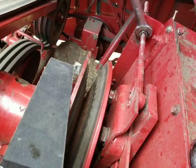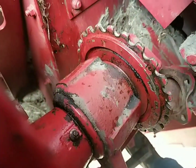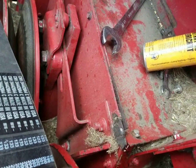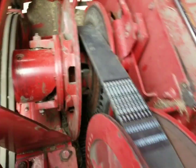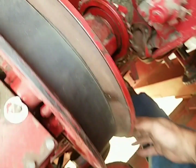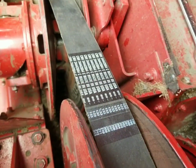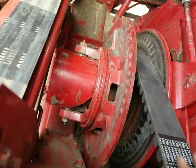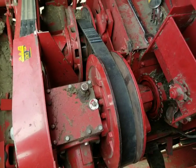But you've got to loosen these two bolts first. It moves slow, not very fast. While you have this apart, this is a good time to thread all this out and really lube it up good so that this little electric motor can turn it easily. What you'll actually have to do is get the belt back out of this pulley, lay it to the front here, spread this one out, then get this belt inside of here, and then come back over here, put the rotor in neutral, and turn this — and this belt will run right on this pulley and fall right in. Another hard part is when you're putting the belt up here, is getting it squeezed around here. You'll have to hold the separator belt out and get it squeezed around the nose of this pulley to get it around there. It's not a real bad job, it's just messing with that big belt — it's kind of tricky, getting it twisted around where you need it.